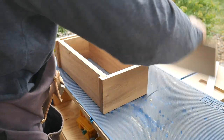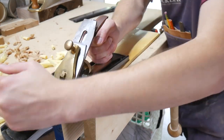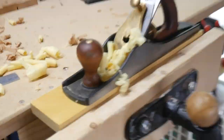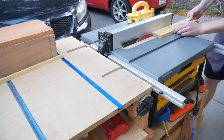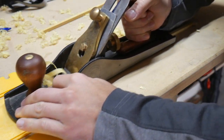The bottom had such a good fit into that recess that I just put down a bead of glue and pressed it in without any clamps. While that was drying, it was back to the lid. I've got some yellow heart from my last project and I'm cleaning that up and getting it milled. Yellow heart can be pretty grainy with a lot of figure, which can be difficult for planing, but I got through it better this time. I'm ripping it to thin strips at the table saw — that's where the rip fence comes in really handy for cutting quarter-inch and eighth-inch rips safely.